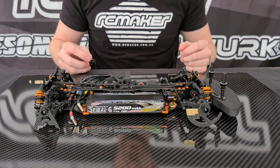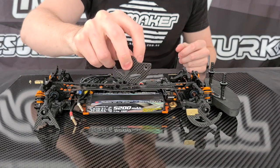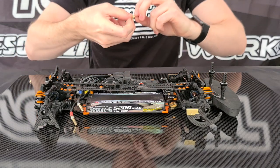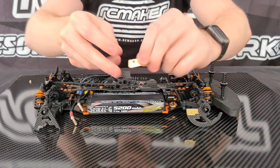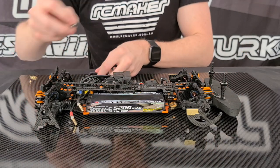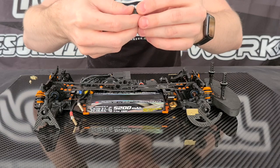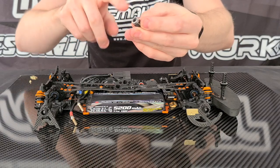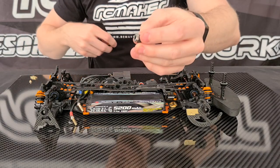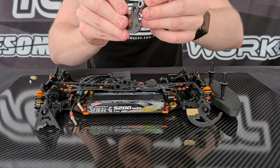First off I'm going to share a little bit about how these tweak wheels are constructed. We start off with a three millimeter carbon wheel that we've machined. It's countersunk on one side for the screw hole. We've also machined a 2.5 millimeter brass weight with a little laser engraved logo on each one. We also have a custom made black knurled nut.